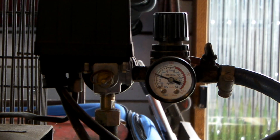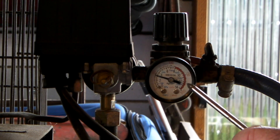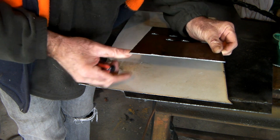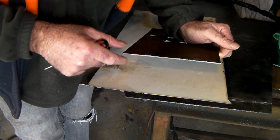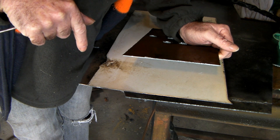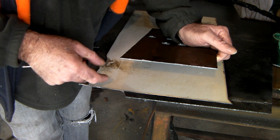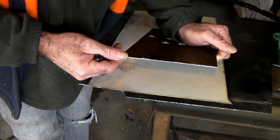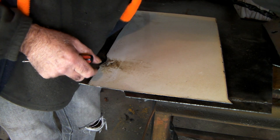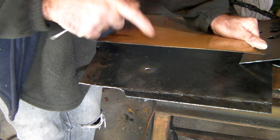So we've backed down to about 50 PSI - half of what I had originally. That should make the volume in the tank last twice as long. What I've been cutting for years is 3mm plate, and that takes a little bit of air. It's not so much the pressure of the air, it's the volume you need - especially for long cuts. The longer the cut, the more volume of air you need. Short cuts with really thick metal also need a lot of air.